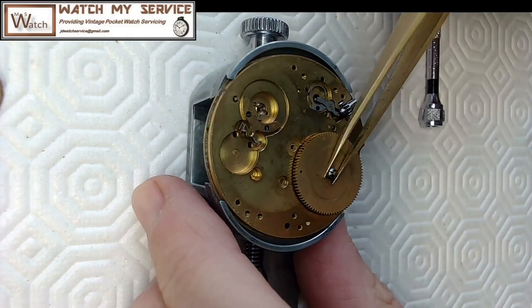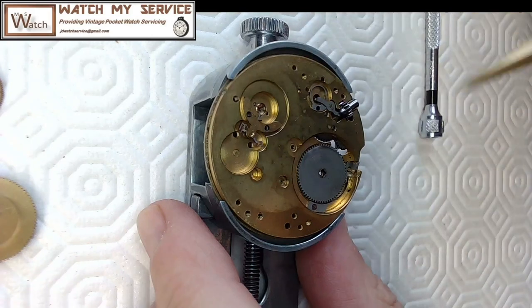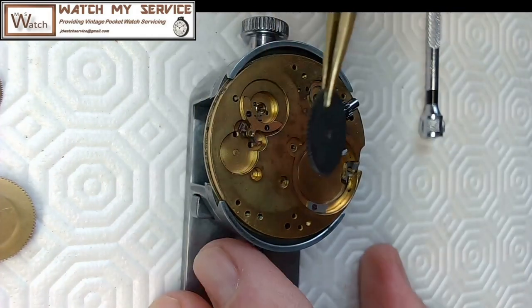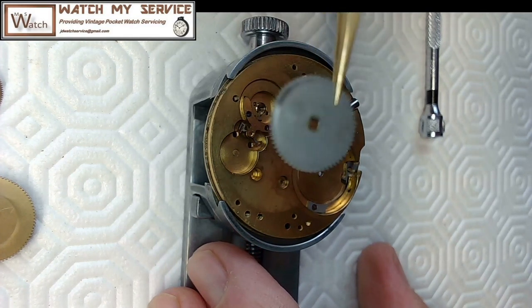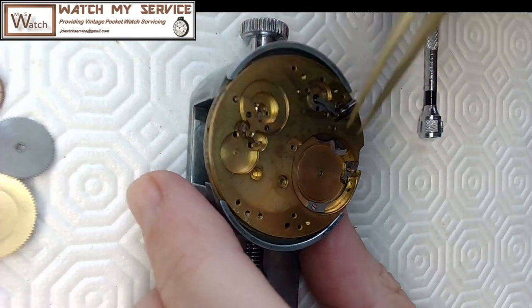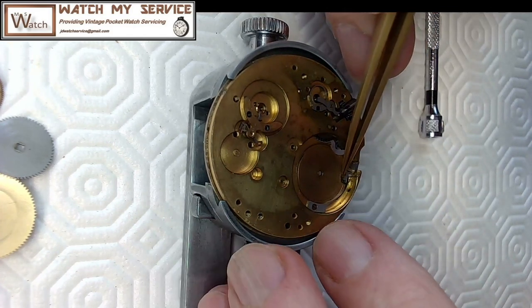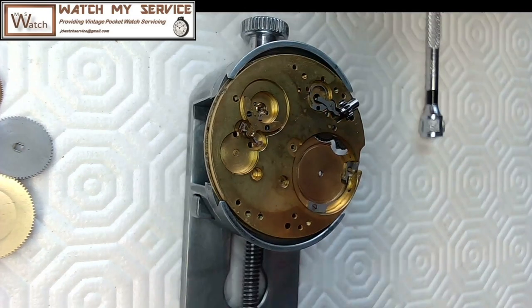Take out the mainspring barrel. Come straight up. That's one of these guys, eh? And I usually look at both sides here to see if there's a difference. No, there isn't. Usually, sometimes there's a sweep in the gears, so it's beveled slightly. This time, there's no beveling in the gears. Yeah, and there's a spring on the inside here. You could probably remove that spring as well.